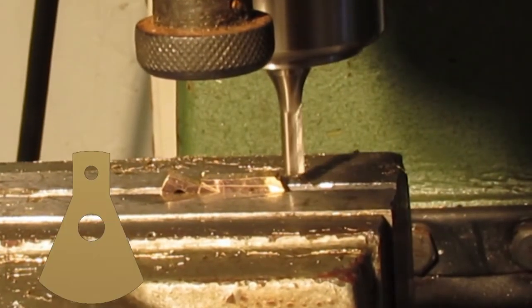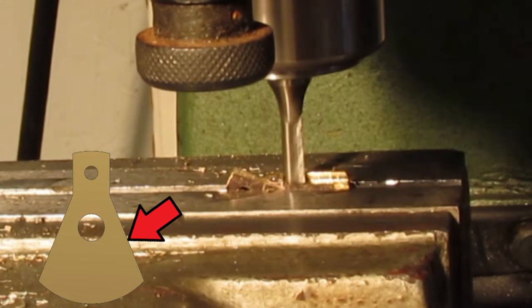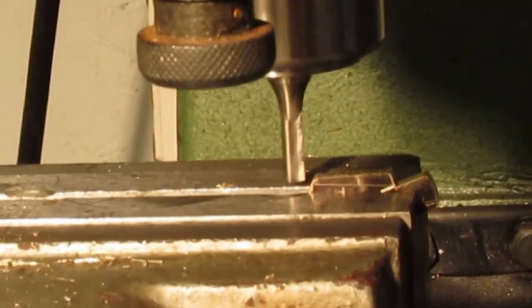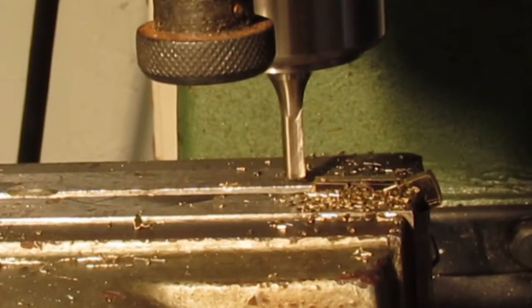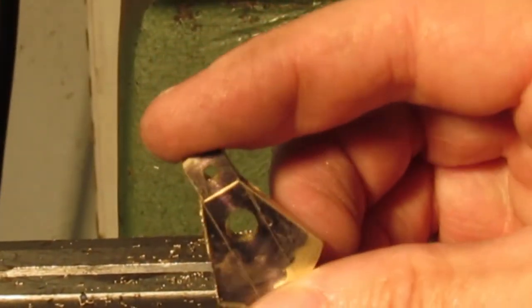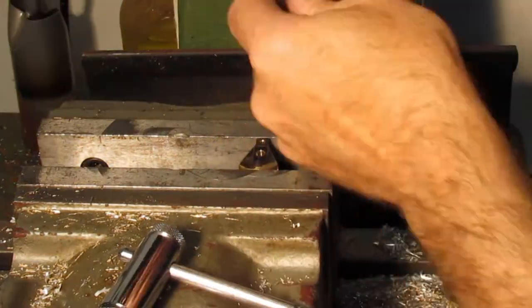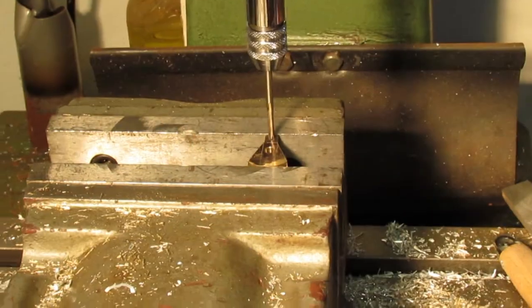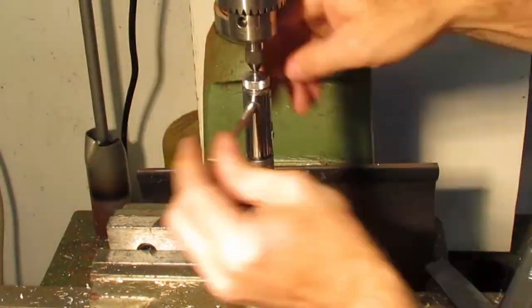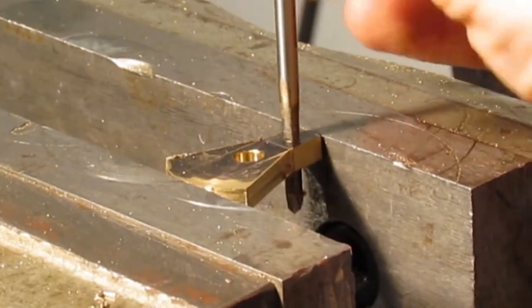To mill the web angles, I set the parts in the vise, eyeballing the scribe line to the vise jaw to make the part parallel. The first side was a little too deep and the second side a little proud — at a later time I will finish all the surfaces. I should have tapped the hole sooner but was interrupted for the day. Setting the crank web in the vise, a 2.5mm drill bit is used to pick up the drilled hole. After this, I use a spring loaded tap guide to align the tapping handle and a 3mm by 0.5 pitch tap is used.